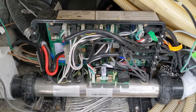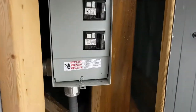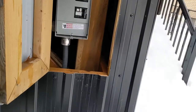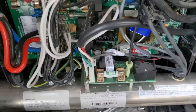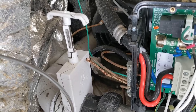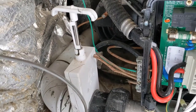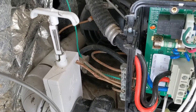First, turn the power off. This swim spa has two packs, so this is the one we're going to turn off — make sure it's off. The water's in it, we don't want to drain it, so we're going to have to turn that knife valve. I normally never touch those knife valves because they always stick down. But everything's hot right now, so if I do it quick enough, it might not swell up.